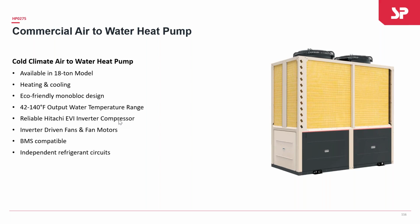Now, if you're consistently needing larger volumes of energy, larger capacities, we offer a commercial air to water heat pump. Not nearly as sexy looking, I gotta say, but it sure does put out heating and cooling energy, right? Delivers up to 140-degree water temperature, has 2 variable speed compressors in it. This is a commercial application.